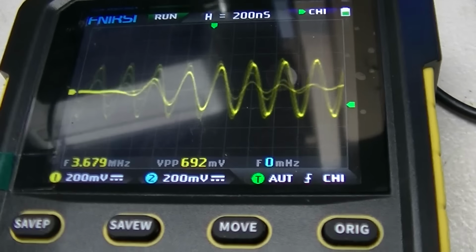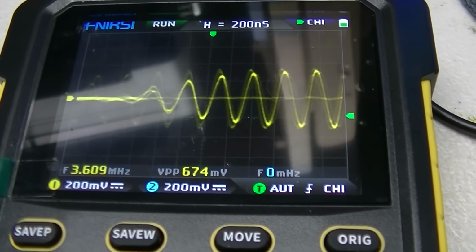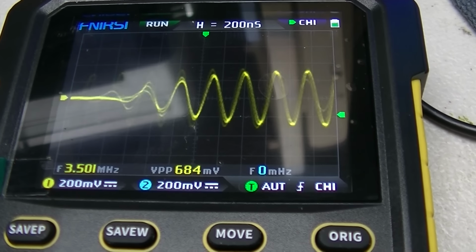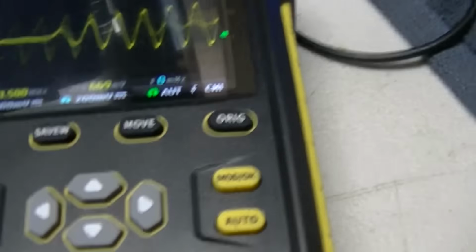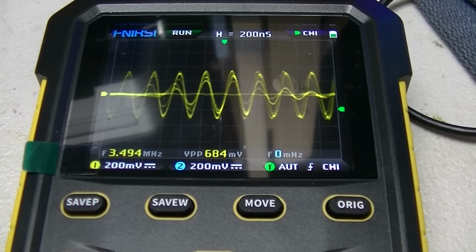So what I'm doing is I'm watching this, and I see how it jumped there? See, the jump corresponds with the color getting brighter on the screen. See that? So that almost suggests that the problem is before the brightness, before the color control.